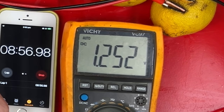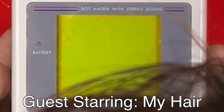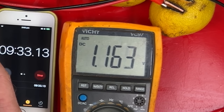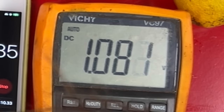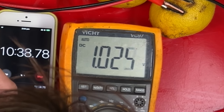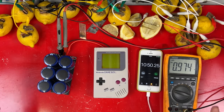1.25 volts — one and a quarter volts. I've got the fire flower, I think. I really can't see very much anymore. It's still going but it's so hard to see. I fell off the level. I can't believe it's still going. 1.16 volts, it's so dim — it's nearly impossible to play now, but it is still on. It is unplayable but it is still running at 1.08 volts. I don't think it's taking button inputs anymore. I can see a tiny ghost of part of the level but I can't make it move. At 1 volt — I think it's gone. It's gone.